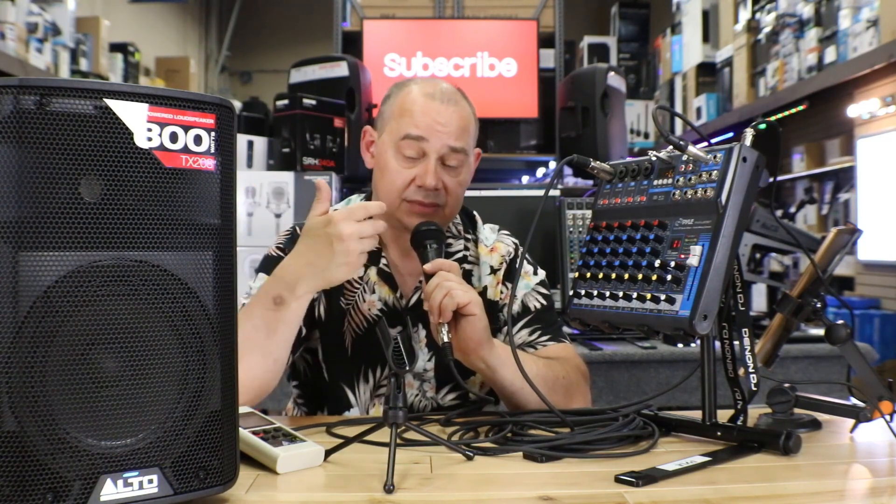There are a couple of things you've got to do on your microphone. First, you have to make a choice. I like to have a lively mic, so I tend to have my red knob — which is my gain control at the very top — set to three quarters. That's just my choice. At this point, I do want to hear myself over the speaker, so I make sure the speaker's only on at 25%. I set the level at 50% because after doing some tests, I've realized that the level controls of the actual mixer reflect against the actual main line, which is what's getting recorded on the actual unit.